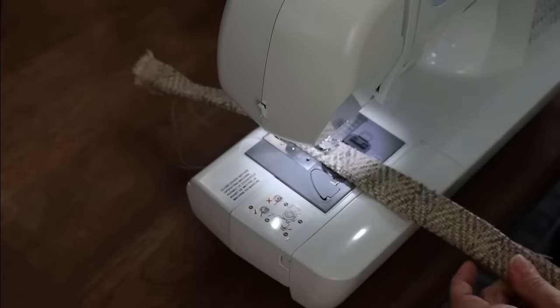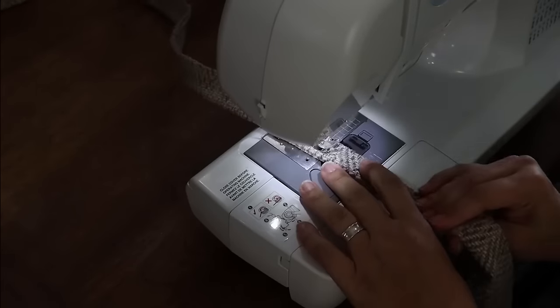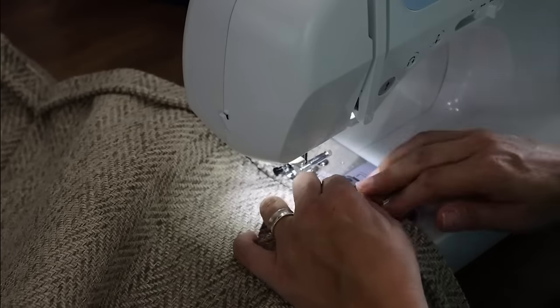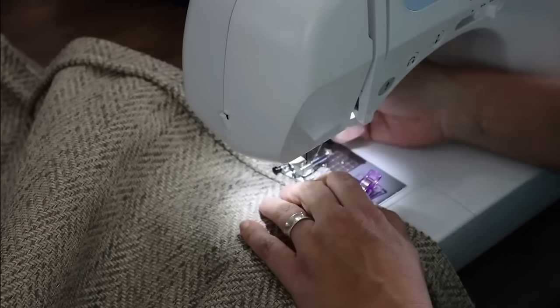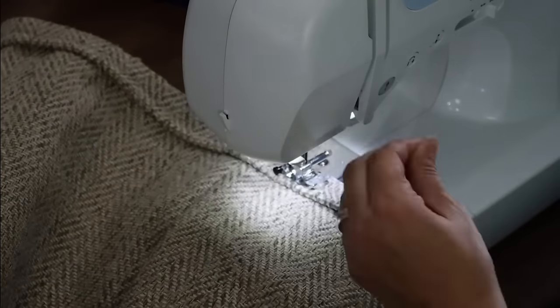It was ready to upholster. I used a sewing machine for this — there are ways without one but I feel it gives a more polished look. I cut out the side panels, pinned the fabric around the side to make sure it was nicely fitted, put some clasps on, and sewed it together in a circle fashion. Looking at the inspiration photos, the ottoman didn't really have piping on it, but I feel a little piping gives a very nice finished look, so I went ahead and created some. Just stitch, stitch, stitch, stitch — very simple. Once the piping was ready I sewed it to the top of our side panel fabric.